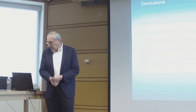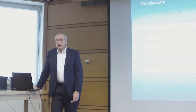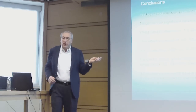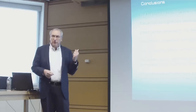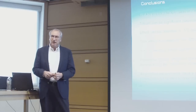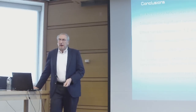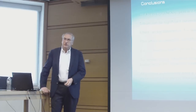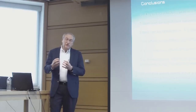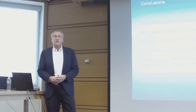Larry, did you measure the resistivity of that wire as a function of where you thought it was loaded? No, it's tough to do. It's tougher than the other wire, the long wire. This is only 50 milliohms, so it's a little bit. And you're running large currents through it, so it's like 50 milliohms one way or the other. And that nickel doesn't load much. Plus it's changing its shape. So all bets are off.